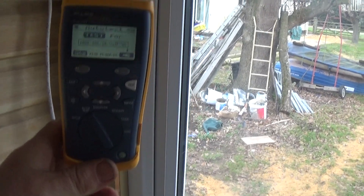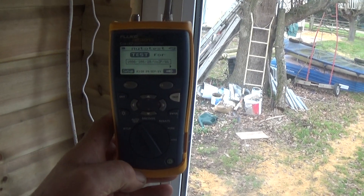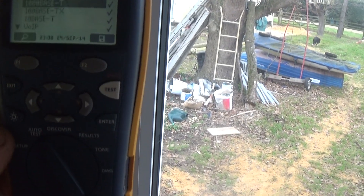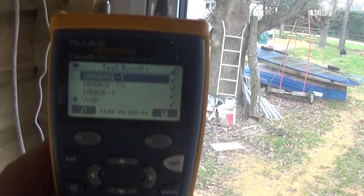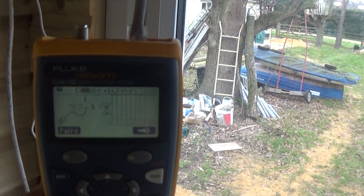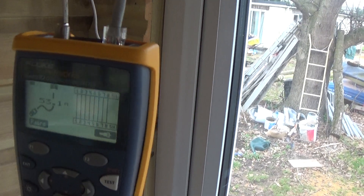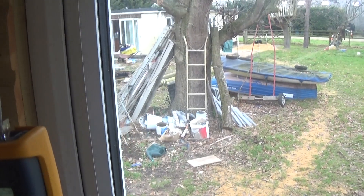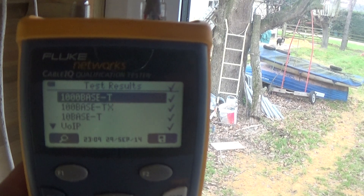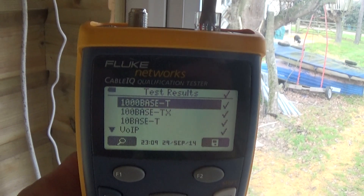Another big shout out to Doc Walton. I've got my ethernet cable going under the grass — quite a long run for me — so let's just run a test on it. Testing... and we've got gigabit! We've got all of them. Running at 53 meters according to that and everything looks to be hunky-dory. Running the auto test again — there you go, a nice little noise showing that everything is okay, none of the wires are broken, nipped, or bent around too far.